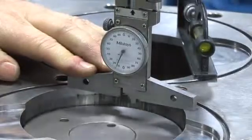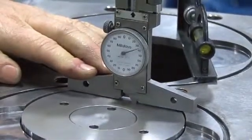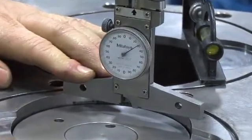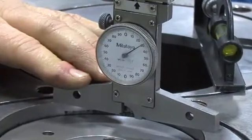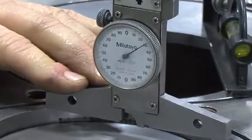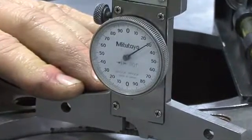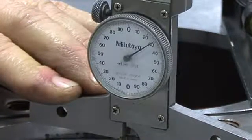For the LB601 compressor, the piston clearance is between 0.020 inches, or 20 thousandths, to 0.035 inches, or 35 thousandths. That equates to 0.508 to 0.889 millimeters. As measured, the clearance on the unit shown here is 0.030 inches, or 30 thousandths of an inch, which is within our tolerance range.